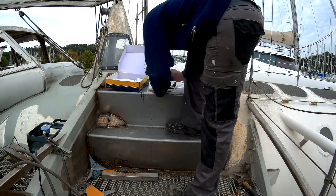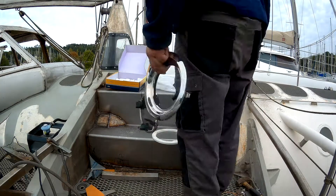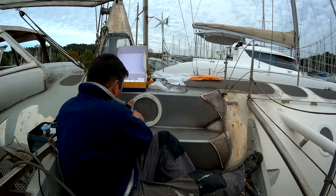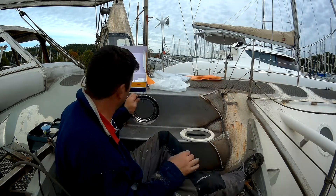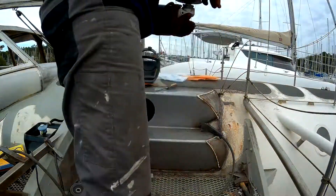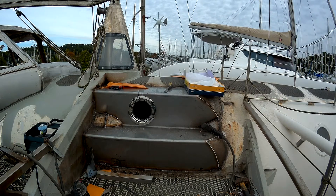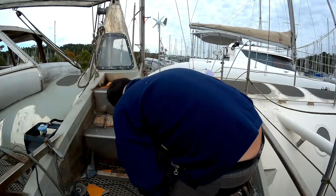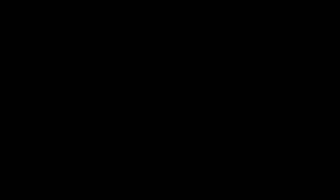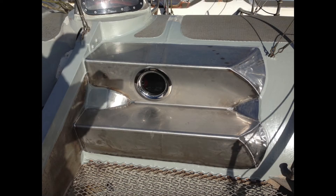What I'm doing here is fitting a nice Vetus stainless steel port light. I managed to get this relatively cheap from a place in Portsmouth — if you go online they give you a reasonable discount off retail. I wanted the stainless steel port light because it's classified to A1, so ocean use — it's the highest classification you can get. I wanted it in stainless steel so I wouldn't have any issues with electrolysis in the joint. It also came with a nice little mosquito screen on the back. I positioned it slightly over to one side so I don't kick it every time I walk up and down the steps, and in actual fact it worked fine.